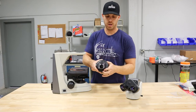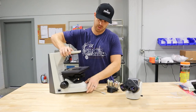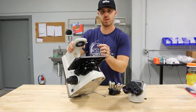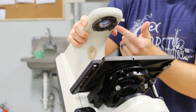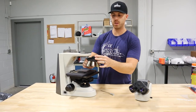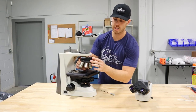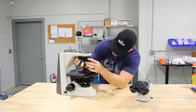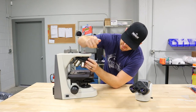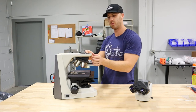In this case, the Nikons have this groove here — you have to put the indent in. There's an indentation. So you want to start about halfway in. It doesn't slide in all the way — it'll get caught and jammed, which can be a pain. So you want to go halfway in, then go up, and then slide it back. Once it's locked in, you'll notice that the front of the nose piece is flush with the dovetail. Then you lock that in with the same two millimeter Allen screw.